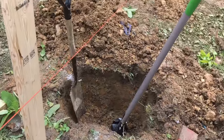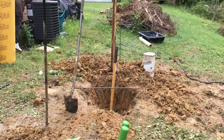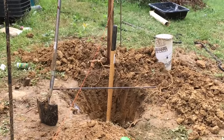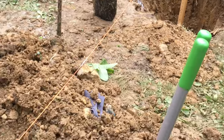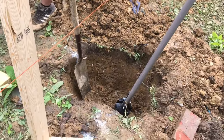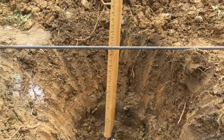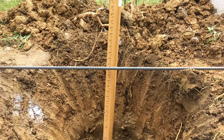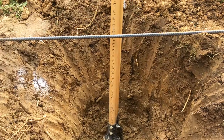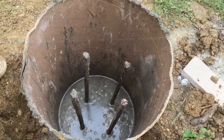The way I determined how to make these holes in line was to measure 10 feet exactly away from the wall and run a string there. Then I put a little mark at 2 feet in from either of the edges, so these two holes are now 10 feet apart. I wanted to go down below the frost line, which in the Cincinnati area is 32 inches. I used a piece of rebar stretched across to confirm it was about 33 inches deep.